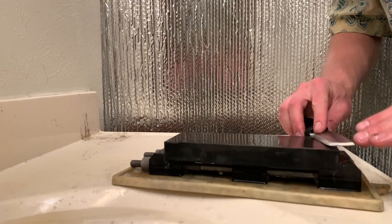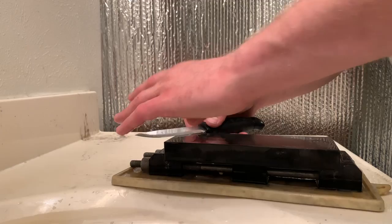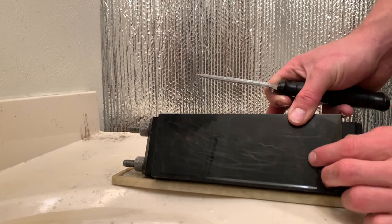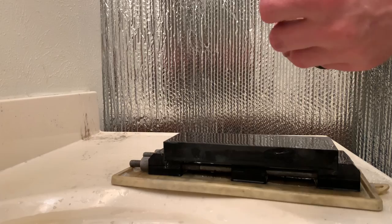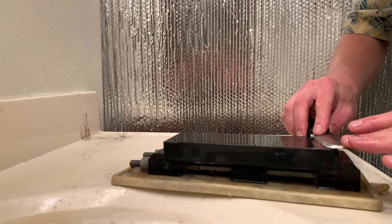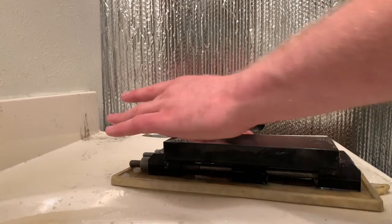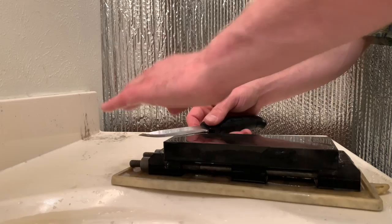I find that a fine diamond plate is actually really nice, because as I'm sharpening, the stone is not dishing. That is why it loads up with metal. The pores are open enough that they eat steel, and I'm not cutting into the stone. The stone is cutting steel. This happens with every single steel I've tried with these stones, and even extremely hard to hone knives in super steel seem to sharpen no problem with these jasper stones, especially if the surface is not totally loaded up.